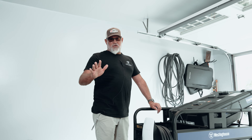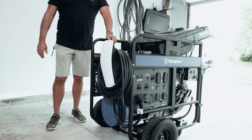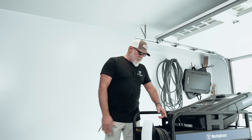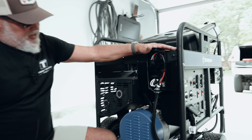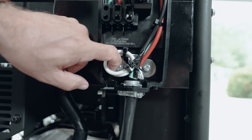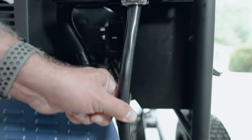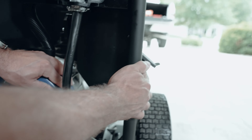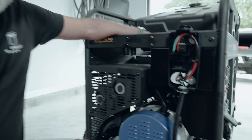From there, we're going to show you how we mounted the wall connector. First, I'll take the front of the Tesla universal wall connector off to show you how we wired it. Down in the wall connector box, we've made all the connections Tesla recommends — going left to right: green, red, black. We're not using the neutral, so it's coiled up. We've left this in the normal factory loom and are plugging into the 1450 on the front of the generator, running the wall connector at 40 amps.